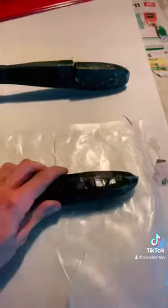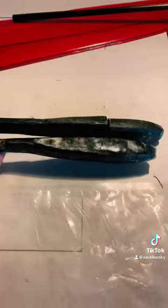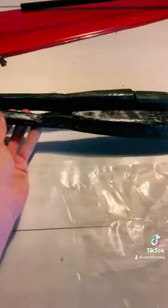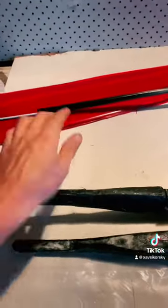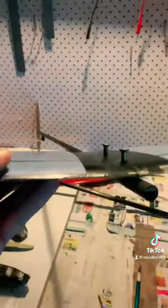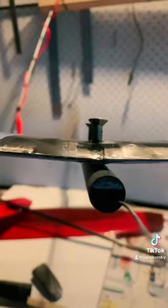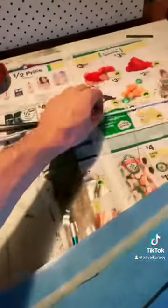I've got a vacuum bag, so it's cured. It is a slightly different design, it's a more organic design. The last one — the wing mounts on the new design are a lot smaller, they're actually internal, not external like this one. Because as you can see with these wing mounts, these bolts are a little long as I'm trying this new design out, but it's actually completely epoxied in with alloy threads and still got room for ballast and pushrods.